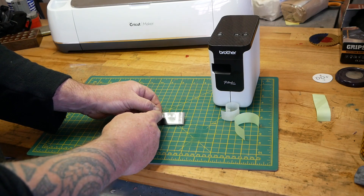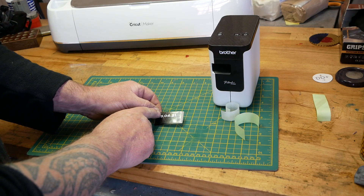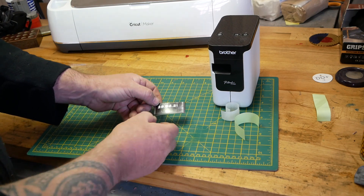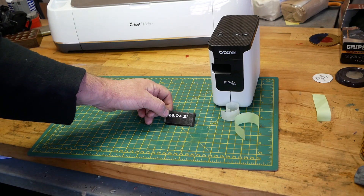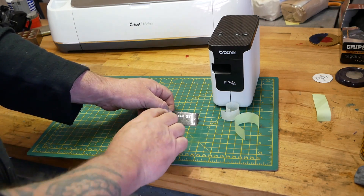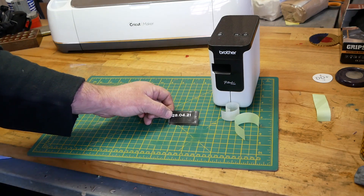What you do is pick out the outlines with a special tool — a pick, really — and then you have to make sure that the black marks in the center of the O, the 4, and the 8, for example, stay there. Then you put a layer of transparent adhesive tape over the top so that when you actually stick it onto the blade, those center pieces stay on. You then remove the adhesive tape and can etch through it — that will become more obvious when I do it.